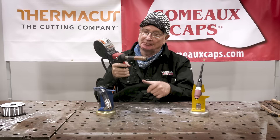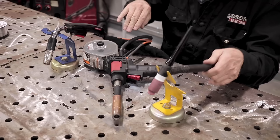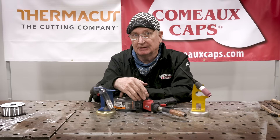As far as a TIG, you can get 25 feet away with that, but with two hands you can't get into tighter areas because you're holding the torch and the filler. The MIG gun — you're going to put it on the back shelf because after it bird-nests the first seven or eight starts, you're going to be really frustrated with it. I've tried welding with these and it is really, really difficult to do.